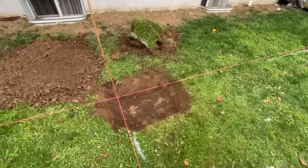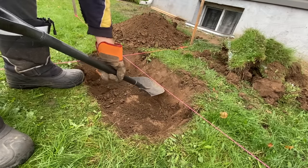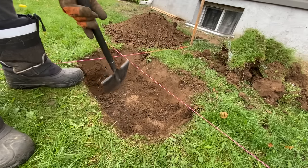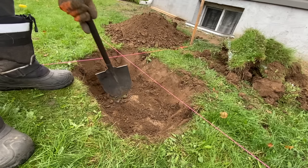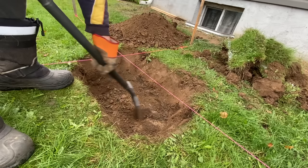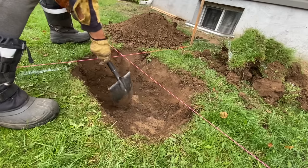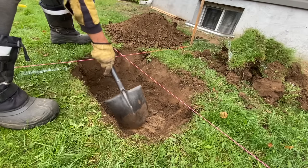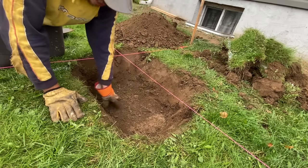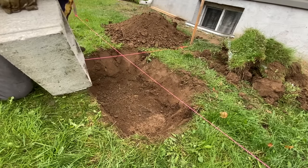Okay, let me show you the plan here. Okay, so the first like 1.5 feet down is mushy stuff. So if you put a garage on it, it's gonna go up and down, it could sink. But once you go like 1.5 feet down, see, it becomes rock hard down here. So all you gotta do is level this out a bit. You could buy sand and fill it with sand and kind of level it, but for now, we're just gonna do that. Put your cinder blocks in this way,